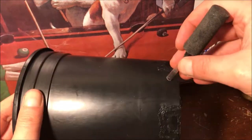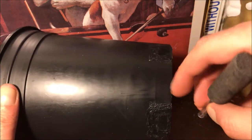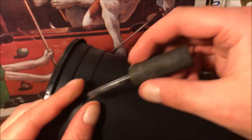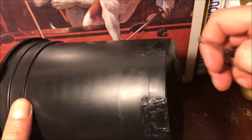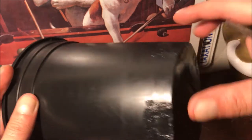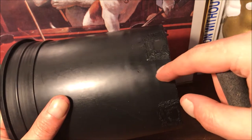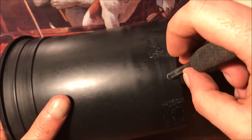Two possibilities here. We can either cut a hole and then seal it up around the tubing with some silicone or some glue, or maybe a combination of both — silicone on the inside and some epoxy on the outside to give it some rigidity. Or we can cut a hole and put a grommet in to try to make a seal that way.